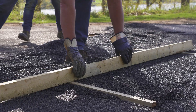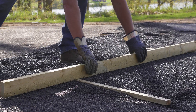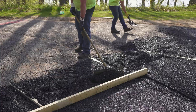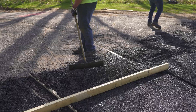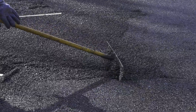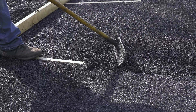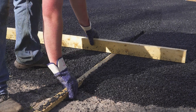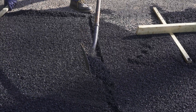If the area you are pouring is multiple pours wide, make sure to keep a wet edge by pouring multiple pours wide at a time. The easiest way to do this is to move your middle form board with you as you screed, then replace the material with a shovel and flatten before finishing. We recommend having multiple short form boards so that you can use the previous form board to roll your edge without having to remove the screed board from the path.